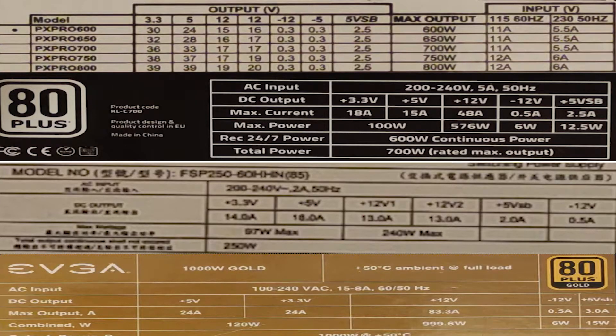And lastly, as promised, a bit about the labels. You would have noticed that some have an 80 Plus sticker while others do not — this is just an efficiency rating and most decent PSUs have it. As I mentioned briefly when talking about the Corsair unit, this is not a requirement, just another plus when making your purchase decision. The most important parameter is the 12V rail or rails, as most of the power will be provided via those, not the 3V or 5V ones. Don't worry too much about the number of 12V rails any given PSU has — they are usually balanced well enough these days.